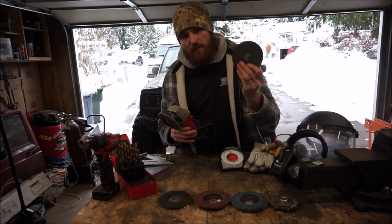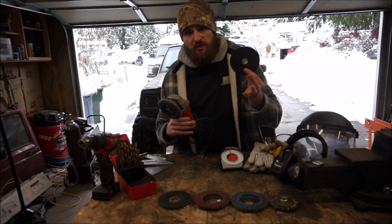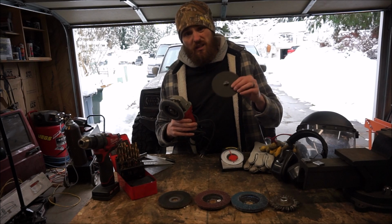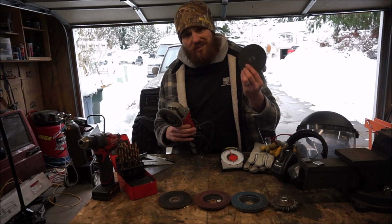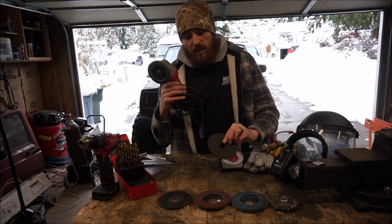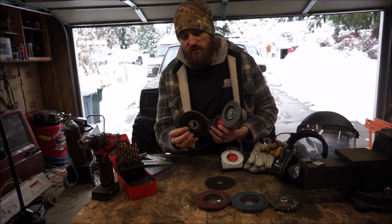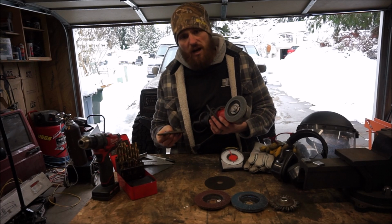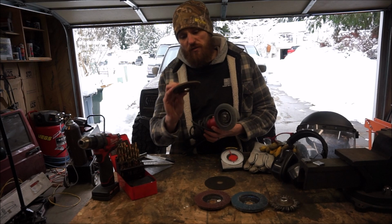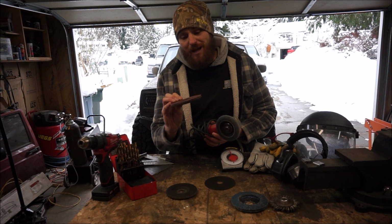It's got the 4.5-inch cutoff disc that you can cut any material you want. I've done stuff, D-ring shackles on my rear bumper that were over an inch of material, inch steel, and it takes a long time and a steady hand, but you can cut it, and you can cut it true with this thing. Another thing I like is the grinding wheels. I usually use these if I'm doing something like grinding a bracket off of an axle housing or something that requires a lot of material to be removed. Get yourself one of these grinding discs. Flap discs. These things are super amazing. I love flap discs.